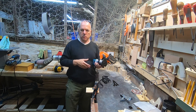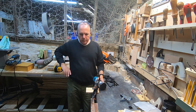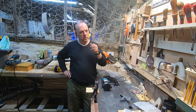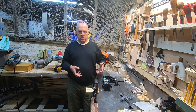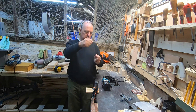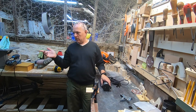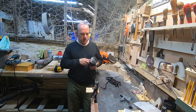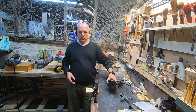One of the reasons I preferred this over the plunge router, aside from the base being too large, is that I'm not really keen on the plunging process — the spring always felt too stiff. What I always end up doing is pushing it down to its maximum setting, locking the lever, doing a route, and then turning it on its side on the work surface. So I actually almost never release the spring — until I did and it broke. This trim router suits me quite nicely: you put your bit in, adjust to the depth you want, do your routing, and put it down on the workbench.